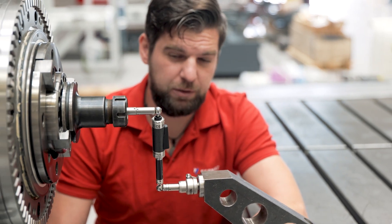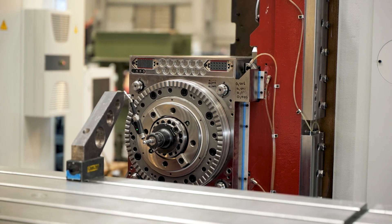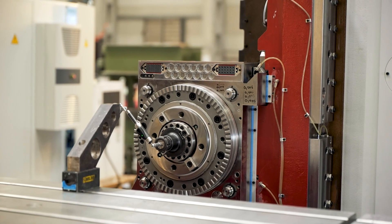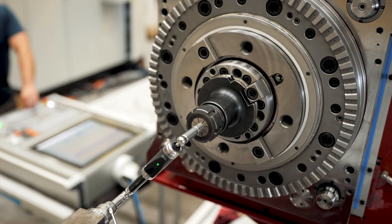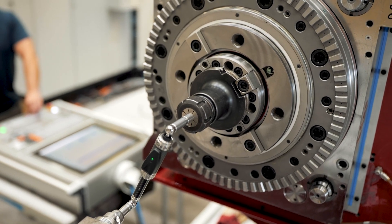It's an accurate linear sensor that we use to measure circular interpolation. The balls are kept in place by magnets — one ball is at the spindle while the other is at the table. This arrangement enables the ball bar to measure the smallest variations in radius as the machine follows a circular path around the mount, which is attached to the table.